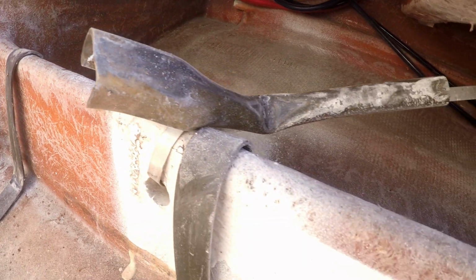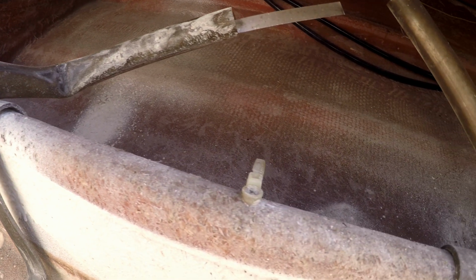Our first look inside the tank area shows the stringers appear to be damage-free. The forward bulkhead looks dry and intact. We see the thin rubber spacer strips and the support banding that held the tank in place. The support holes in the stringer are well coated with gel coat, which is very encouraging. I expect to fill these holes and mount the tank with tabs, not bands.